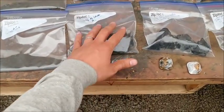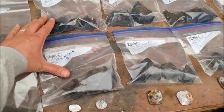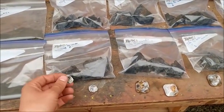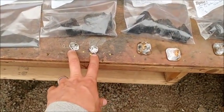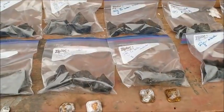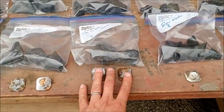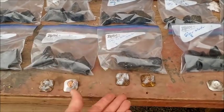The first test I did, and all these are duplicates of each other, I did two samples exactly the same of no collector metal. So I used my flux recipe, added iron to reduce all the metallics above iron on the reactivity chart, but we ended up with two little buttons with no collector metal used. The second one we did, I took high surface area copper and mixed it in with the entire charge, 100 grams of copper. The next one we did was we just added 100 grams of copper right to the bottom of the charge. We put it right in the bottom of the crucible.